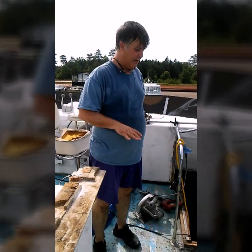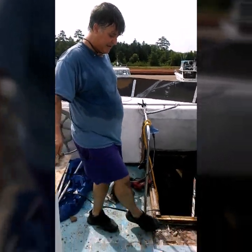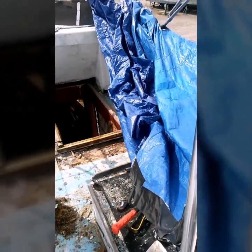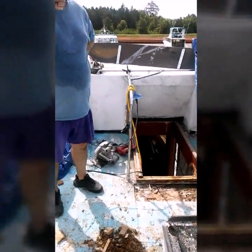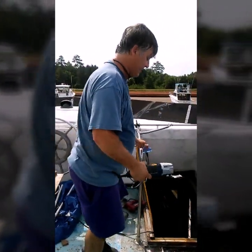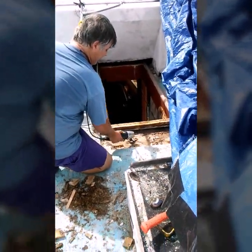I'm going to epoxy them down to the core material I put in. Then I'm going to rout out an area in the seams and sand it back about three to six inches all the way around. I'm going to go in and embed glass and fill it. Some of this you won't see, some of this I might be able to videotape for you. When I'm stripping this out you can see there's still a plug in here, which is the core.